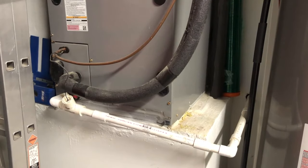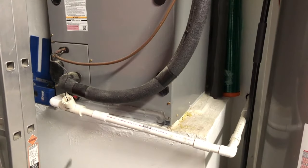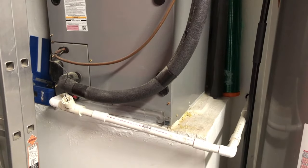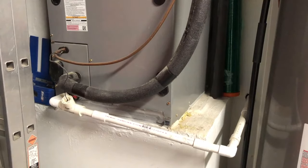How do you put the tablets in the pan? In my case it's just removing six screws to take off the front cover, then you drop the tablets right into the lower portion of the handler. There may be some water already there — just drop them in, they'll start to dissolve, the water turns blue, and it'll start to flush out the line.